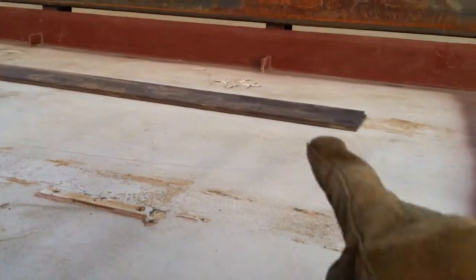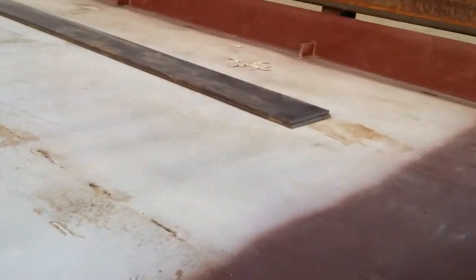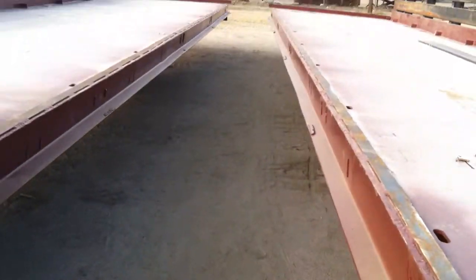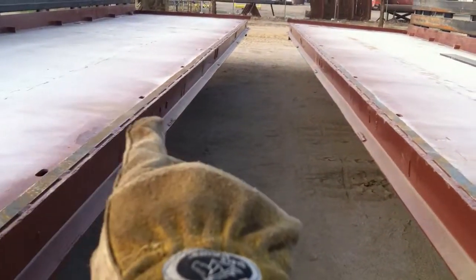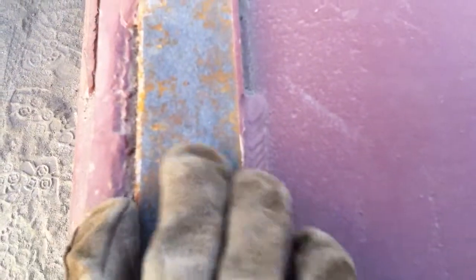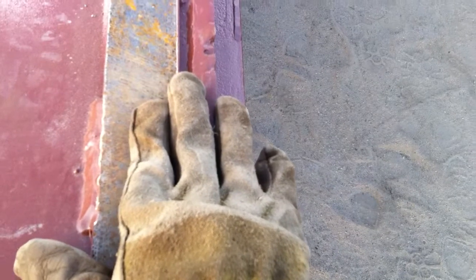Then we also have that flat bar — there's two sticks of flat bar here. When these two sections get butted up, they go from that flat bar here to there. They just help cover the seam up. That flat bar should come right to the very middle. It's a two-inch flat bar, so you have one inch of wiggle room. But it should land right in the middle here, and same thing on this other side.